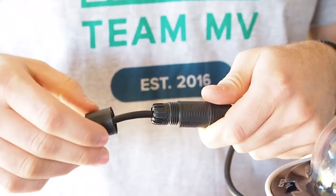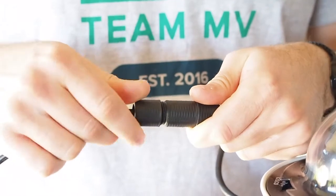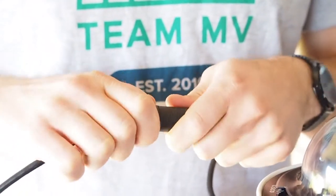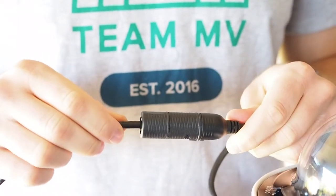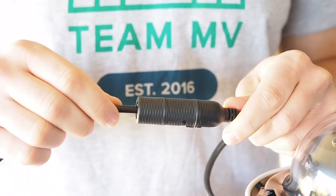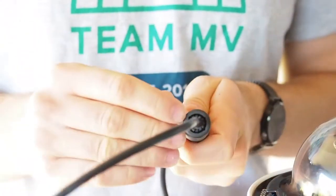Finally, slide the sealing nut over the cage and tightly screw it into the coupling body to create a seal between the cage and the rubber seal. The sealing nut and the cage will compress the rubber seal around the cable to protect it from the elements. The claws of the cage should be evenly arranged around the opening of the sealing nut.